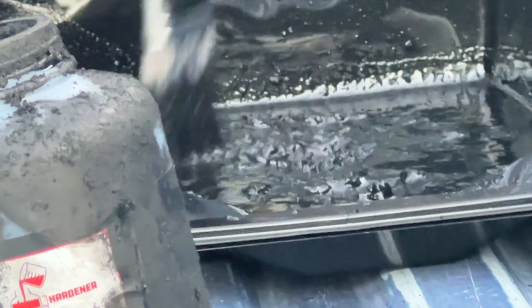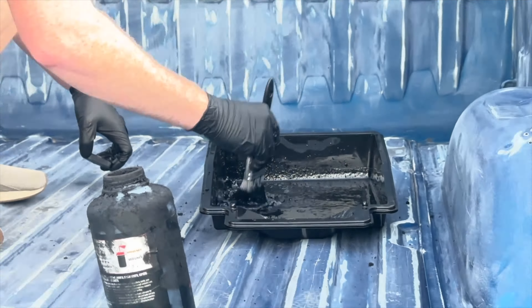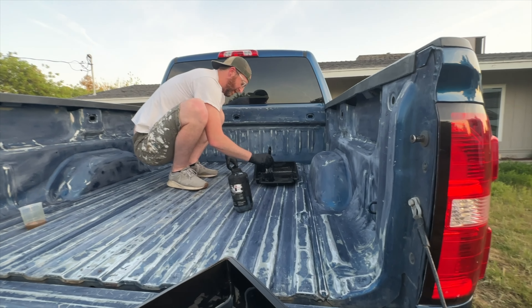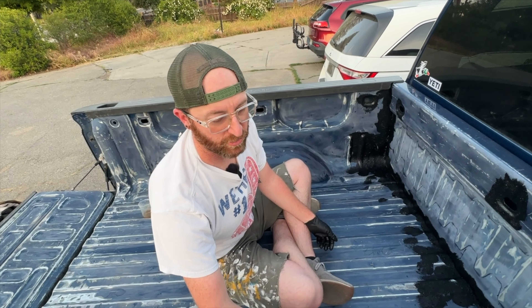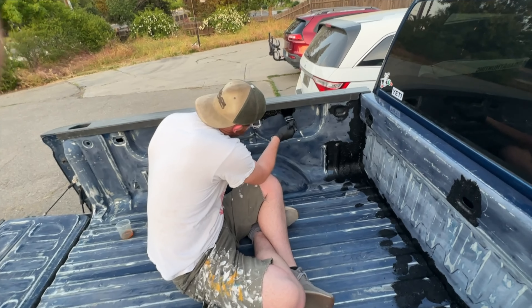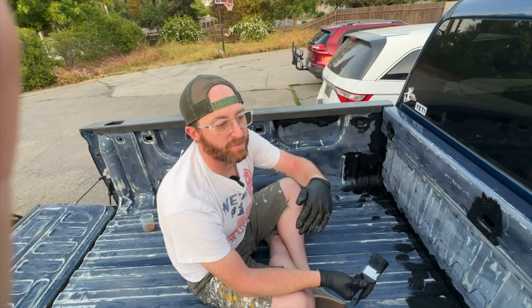I don't think the chunk is the hardener — the chunk seems to be the rubber that goes into the coating to give it texture. So I don't think it's ruined; it's just going to be a little extra chunky and I'll have to do more work to break it all up. You live and learn. Also: as you're brushing in the edges, you don't want to make strokes — you want to dab, because strokes will leave brush marks in the texture and it won't look the same when you roll.